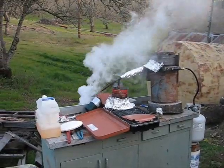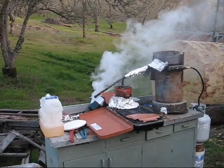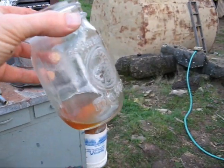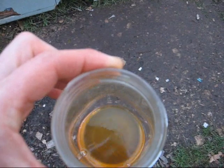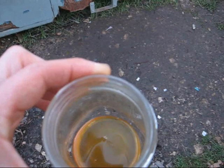We're taking a step back here. We're getting so much high quality smoke, we're now concerned that it's going to flash. So we're just taking a step back and putting on our safety glasses and waiting. But we're generating a really larger quantity of very nice quality oil. We did end up with a very nice distillate. This has a light oil quality to it. It's been refined at a much higher temperature, which is very different from the plastic wax we were getting earlier.